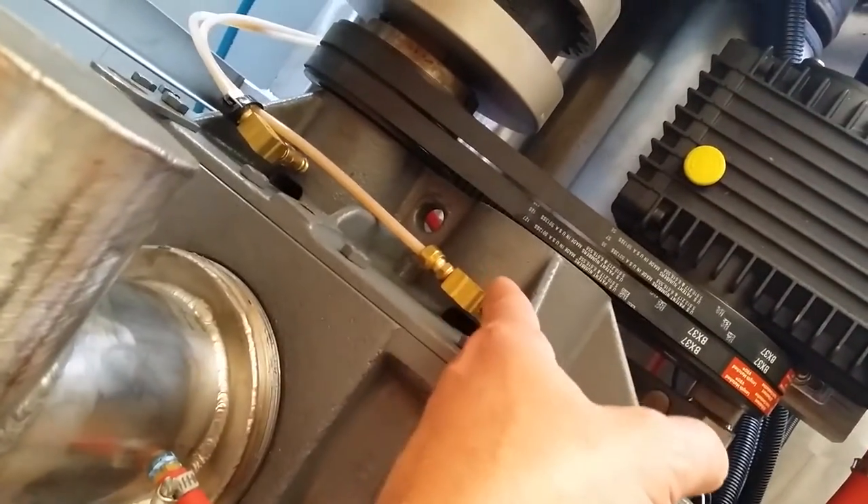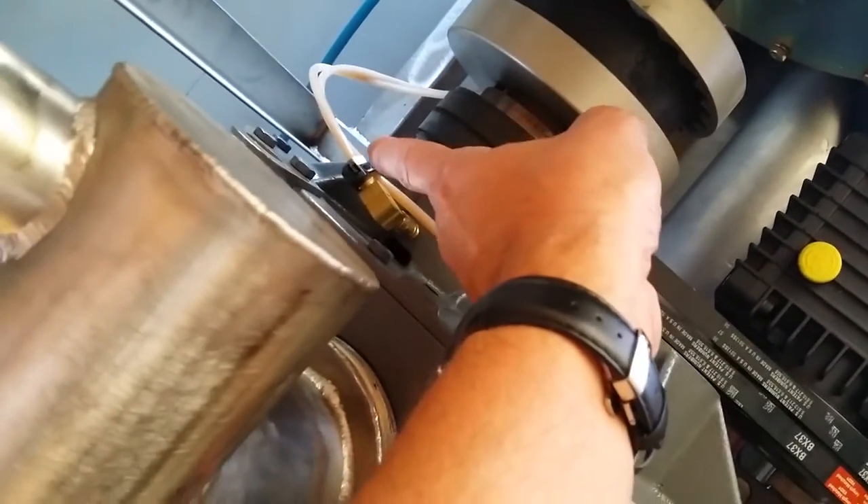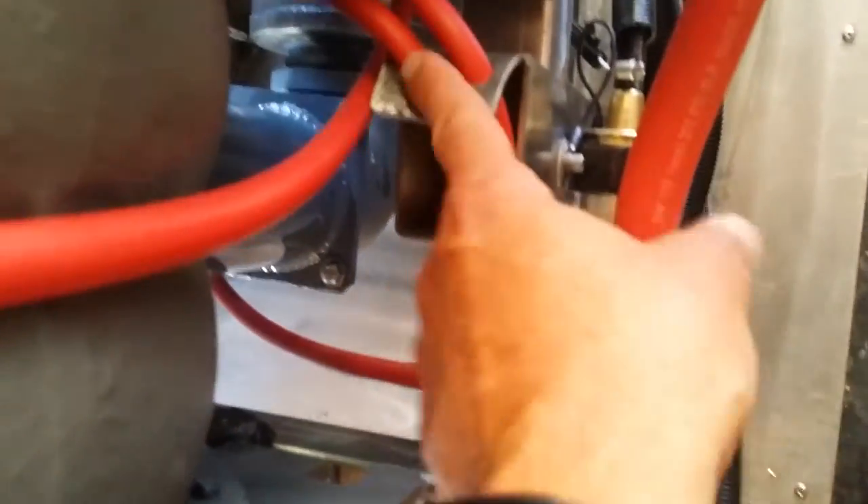You've got two lube ports here — this is a grease blower. Are you able to grease it from the front? Yes, it goes right through. So this hose is full of grease — it has a cup where it gets expelled. That's very clever. Fuel pump. And what's this — your water supply line? That's an antifreeze system. If you want to antifreeze it, just open it up. It's like you thought of everything.